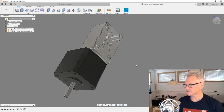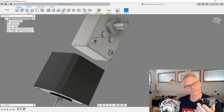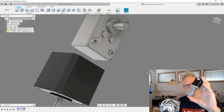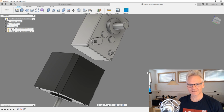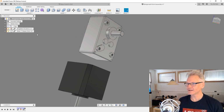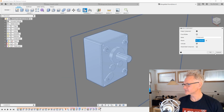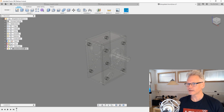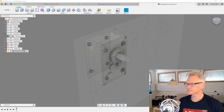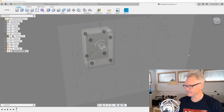And then we need to attach this guy to this guy. Oh, yeah. So I actually see that we need one more thing in the gear, and that's the plate it's sitting on. There's some sort of adapter, so let's make this adapter as well. It's not going to take too much time. So I'm just going to right click on my worm drive and open it, and we are going to make one more component. NEMA adapter, we can call it. And I don't know if we have that in the canvas. Yeah, we have some dimensions for the adapter. It's supposed to be 8mm thick.